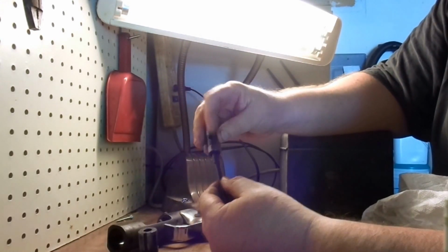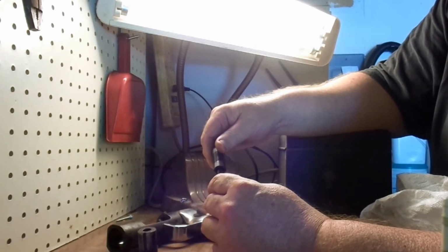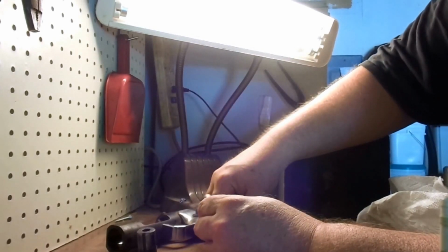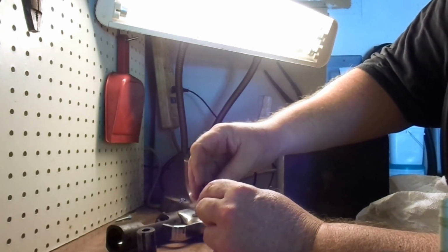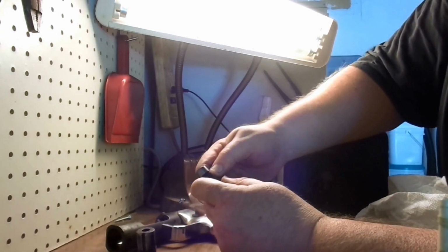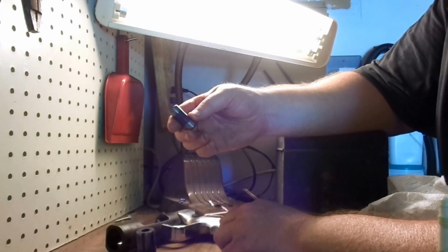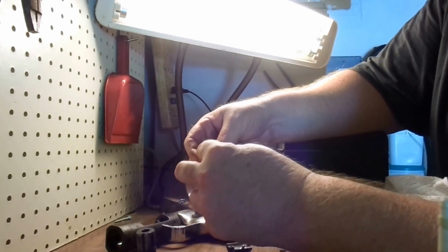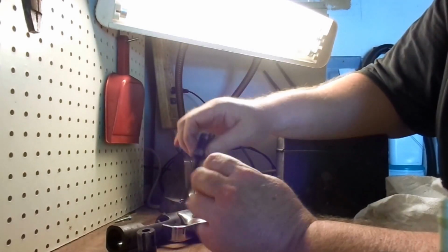There's where the pawl was at. And the pawl spring, which shouldn't be a problem. I can get a spring. It looks like it's very similar to the reset spring in there. So I should get something in there. But the whole thing, this holds the barrel in. Be the pawl. And I don't want to push it in there too much because it might get stuck again. Might have to clean that up a little bit more. Don't want to wire brush it either. But the ball bearing would then be held in by the barrel and hold the whole thing together. So there will be your piston assembly.